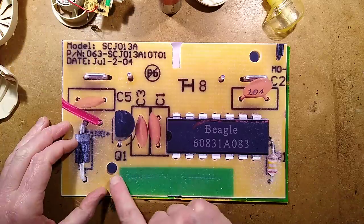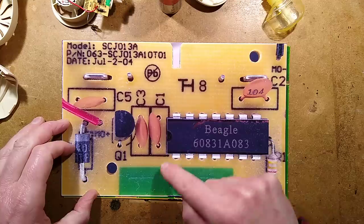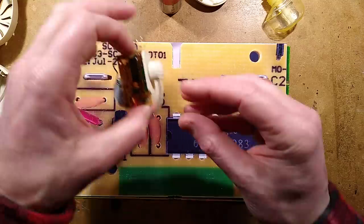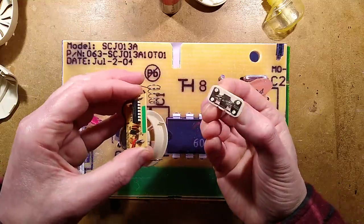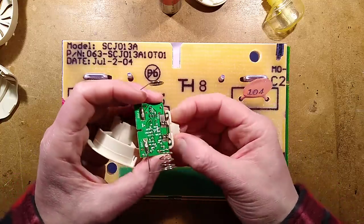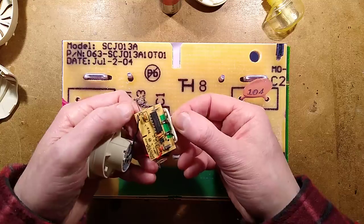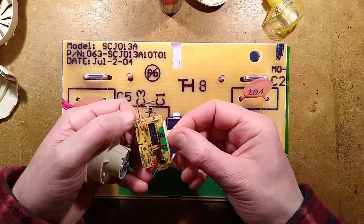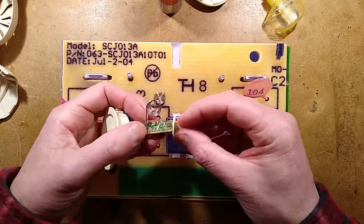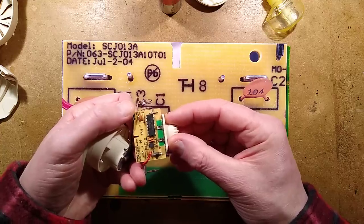The switch — this green layer is an anti-friction layer they've printed on. The switch is literally just a little springy metal arrangement that slides backwards and forwards and onto these two plated pads on the circuit board. The circuit board itself seems quite good quality — it doesn't look like generic synthetic resin bonded paper, though it might be fiberglass. I think it is a better quality SRBP.